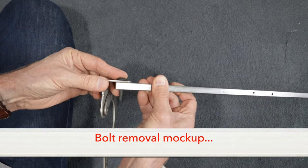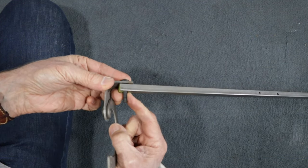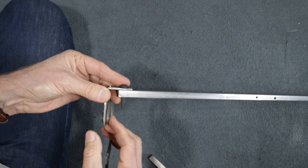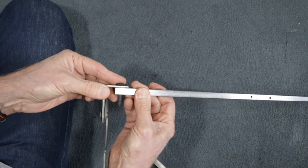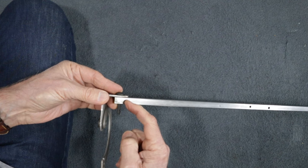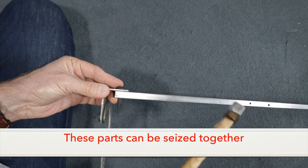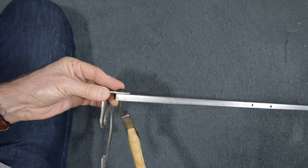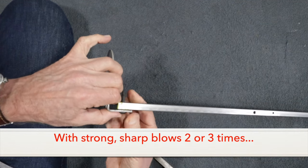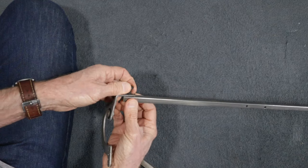Here's a mock-up of these bolts when they're stuck in place. Here's our drive rod, and here's our bolt fit through a pre-drilled hole. This is a sandwich: the bolt head is holding this part onto the drive rod. If I can just break this center metal part loose, that should do the trick. So instead of striking the top or the bottom of the bolt with a hammer, I struck that flange. Then I rotated the rod around and did the same on the other side, and I was able to spin the bolt out with a Torx bit after that.